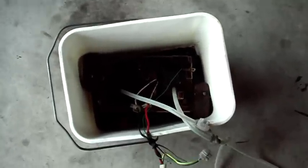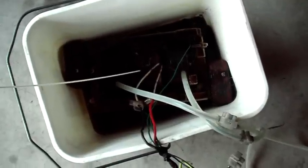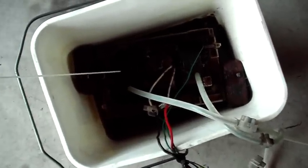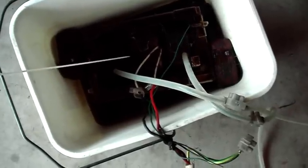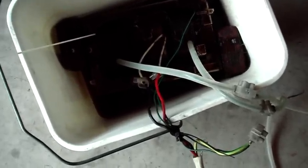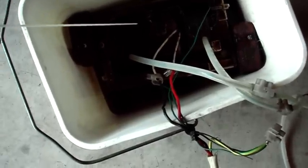This is a video of my Tesla coil primary. Here's the 240 volt primary winding and the two secondary windings. Each of these is normally 7.5 kV and they're center tapped so it's ground. I've removed the magnetic shunts from this and just put pieces of plastic in there to space the coils.